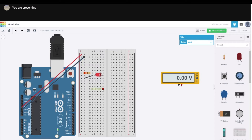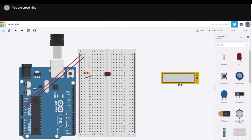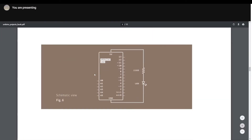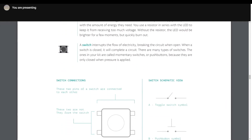Boom, done. This is not the final product. To recap: if I were to switch them around and do it backwards it's not going to work, because the anode needs to be correct. Don't go by the picture — look at how it's bent. The bend is the anode. And if we jump back to the next section, this is what's happening: five volts coming into the 220 into the LED and into ground. That's exactly what we're doing. This is the schematic view, by the way.